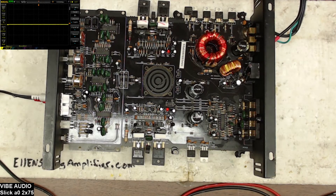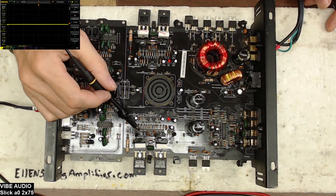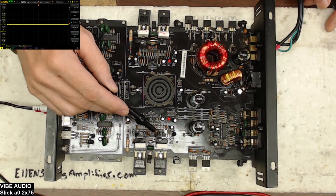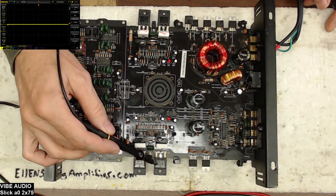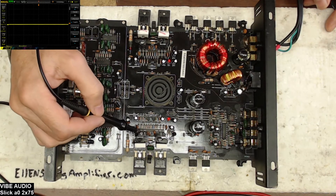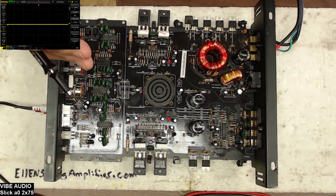I don't have any original video of how the pre-drivers looked, but I can tell you I was missing half of the sine wave, which told me one of the pre-drivers was bad. I also had both output transistors shorted, so I got new outputs installed and then replaced the NPN and PNP transistors in front of those. And of course we just replaced the gain potentiometer.